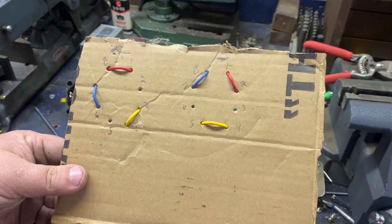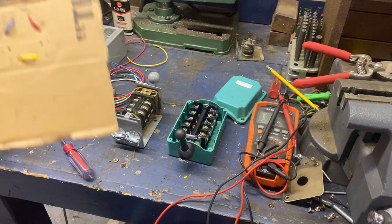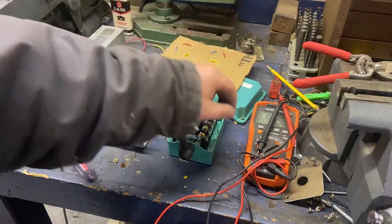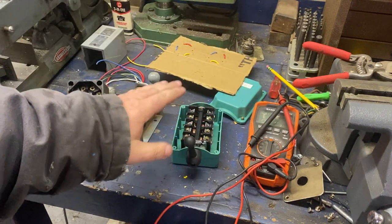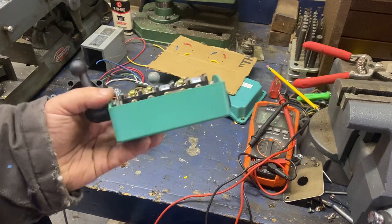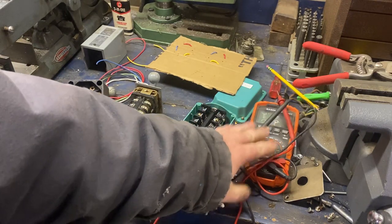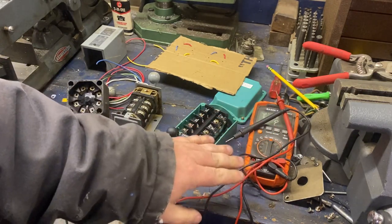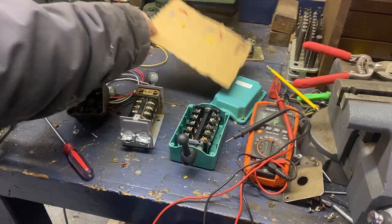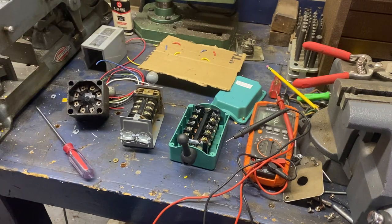Get yourself a sheet of cardboard, colored pencils on a piece of paper — anything like that — and just get yourself a visual representation and it'll become so clear. I hope you guys found that helpful. I have another video on wiring a three-phase drum switch. If you need additional help, email me — my email's in that video and I'll probably put it in this one. I have loved helping you guys out and getting your machines going. A lot of the reason I'm making this video is people have drum switches that don't have instructions, and the first thing I ask them is if they have a continuity tester. It doesn't have to be anything fancy — anything that will tell you continuity will do the job. This is Adam from Small Town Machine Shop. Please comment, like, and subscribe — thanks for watching.